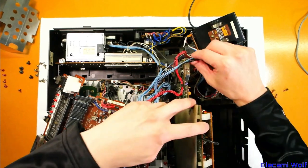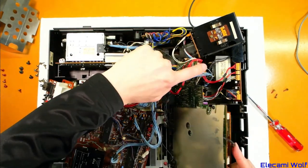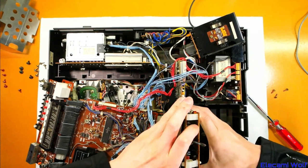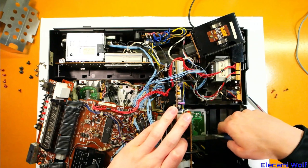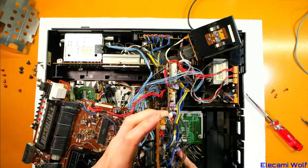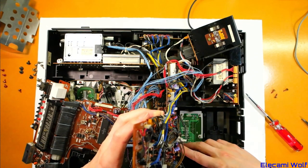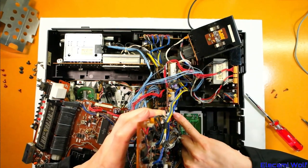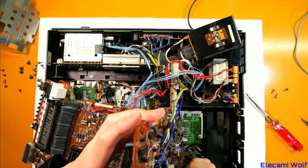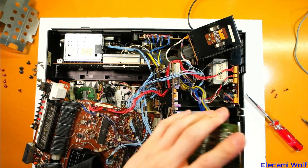There are brown wires coming off the video head and they go into that box, which would be the head amp part for the HiFi audio. This thing here folds out too. Let's see what kind of cap leakage we've got going on in there. More than none. Those lighter purplish coloured capacitors — which is what we saw in the NV870, those ones were leaking — and they are here too. Bad leakage. The black and dark blue coloured capacitors don't seem to be as bad. There are also light blue capacitors here which seem to be alright. That's not a good sign.